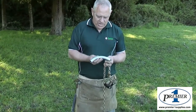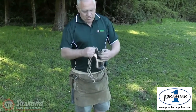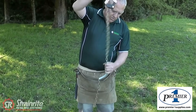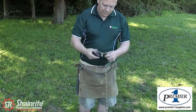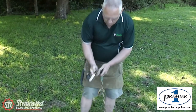This is the StrainRite EasyMate Chain Diverter. Really good if you're repairing wires that are broken on a fence. Just thread the chain of the chain strainer down through it and thread it right to the end — right down by the grab end — and what it does is holds the chain out of the way while you're putting the crimp on.